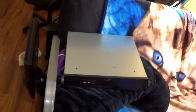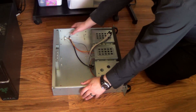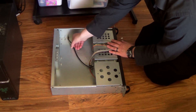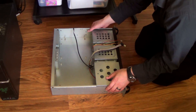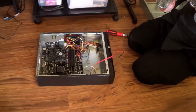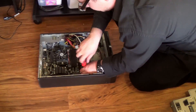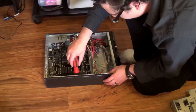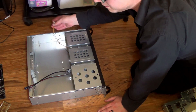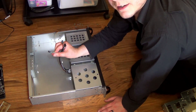Next, we've got to move the server from the old case into the new one. I just got the cover off the case. In this case we get a lot of front panel plugs — power for the fans, a USB hub plug. And it's got this cool thing: there's no screws for the CD-ROM drives. We are now ready to put the motherboard in the case. I decided to hide all the other wires except for a fan plug, reset, power, USB, and power rails.